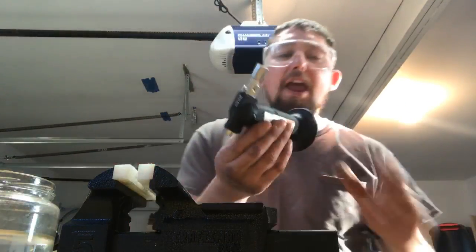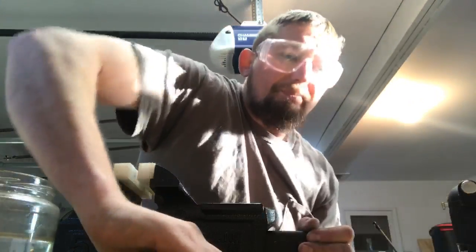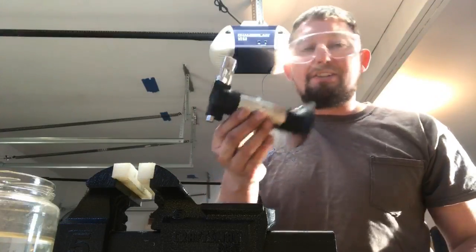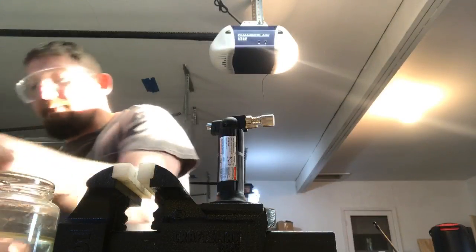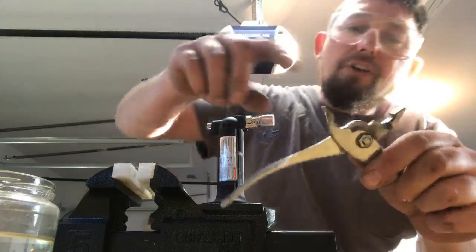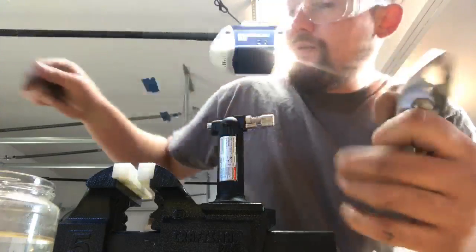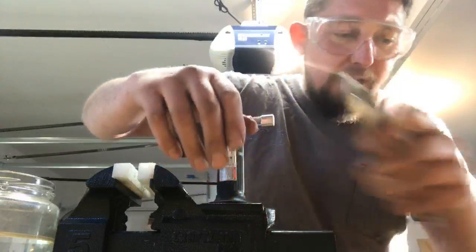At first when I started building, I bought an expensive Dremel torch that had different attachments. It didn't hold up over time, wasn't necessary. This is just a cheap butane torch. I have a pair of old pliers that I got for free. I took and on my grinder, I ground all the teeth off them, and then I polished them smooth with the wire wheel, and then actually took a stone to them. So it's very smooth, and it's a pair of pliers.